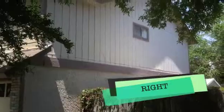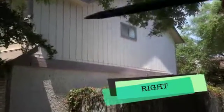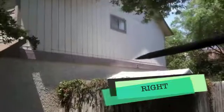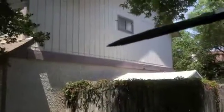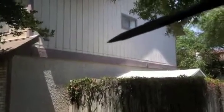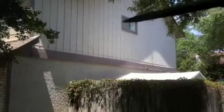On the right side of the house, we're going to be nailing over this siding here after cutting out 1 foot above the drip edge that you've got in here. We'll cut out 1 foot, and then we will put OSB in that place, put the Tyvek moisture barrier, redo the trim around the windows. You'll get a new gable vent up here, and it looks like an 18 by 24 inch louvered gable vent.